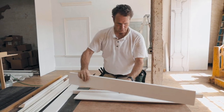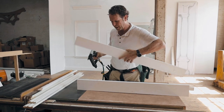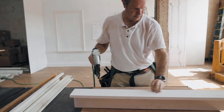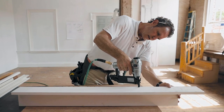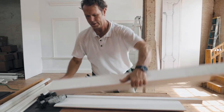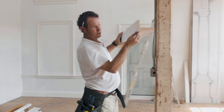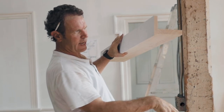Now, I like the cornice as a four-part crown. The cornice is made up of four parts. You have a corona, bed mold, and a cyma. Cyma is the crown, okay? What you're seeing me do here, and what both Kewkin and Windsor have done, is they built me and provided me with a proper drip edge. This was introduced and put onto stone buildings so that water coming down here would drip off and not run down the face.